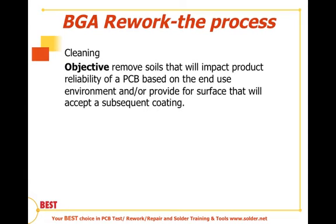The first thing we need to do is make sure that we have, in our cleaning process, enough mechanical energy to break this dam. Typically, that is done either with a mechanical force such as a brush, a high-pressure cleaning source such as a closed-loop cleaning system, or a high-pressure airline-driven cleaning source. Secondly, we need to make sure that our cleaning agent is able to break those soils down, attach themselves to the cleaning agent, and get carried away. So we have to break the dam, and then make sure that the cleaning agent can break those soils down and carry them away.